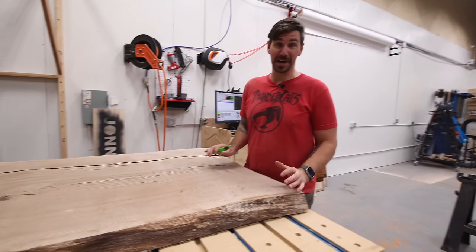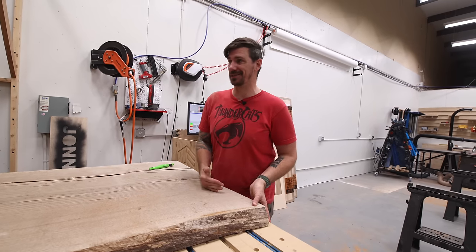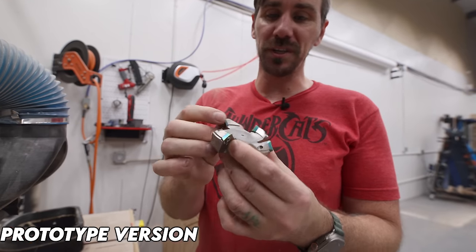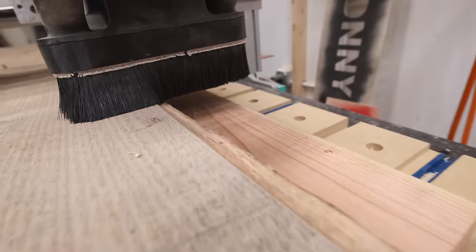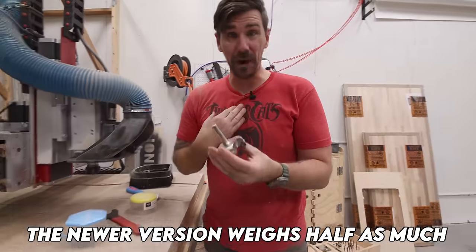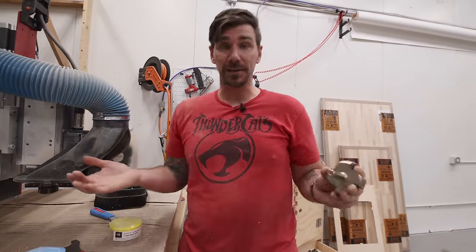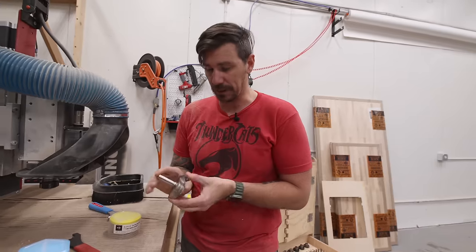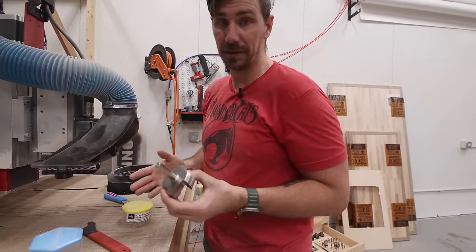This is the biggest slab I've ever had on this CNC. I cut it down to 9 foot 10 inches — the cutting capacity on my CNC is right at 10 foot. This is a two-and-a-half inch flattening bit with carbide teeth. This thing will mow through some slab. I could take a half-inch pass off of this — it's not very smart, but I could. There's no other flattening bit I've ever used that is near as good as this. I bought this with my own money, then started working with the owner of RIP Precision Tools. It's going to show you how it works.